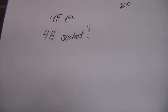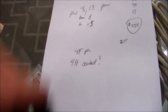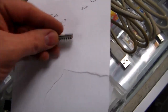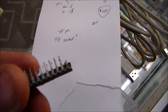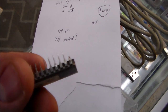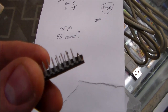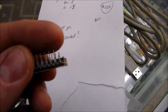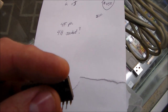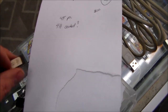Okay, so I replaced the socket for 4F and I reburnt a new EEPROM. Here's my old one. After I took it in and out of the socket a couple times, the legs broke completely off. Neither one of them was that small before, but one was about half full size, and the other one was kind of limp. But it was passing the ROM test, I don't know.